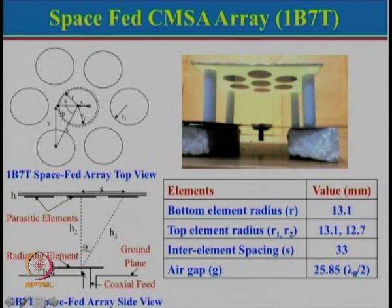We have a number of elements. From the central fed element to a nearby top element the distance is h2, but for an element further out the distance is h3, which is greater. That means the outer element receives an additional phase delay compared to the central element. This additional phase delay can be compensated by making the outer element's dimension slightly shorter. By doing that one can actually design this particular array. Initially we used a 3×3 rectangular or circular array and then moved on to larger arrays as well.